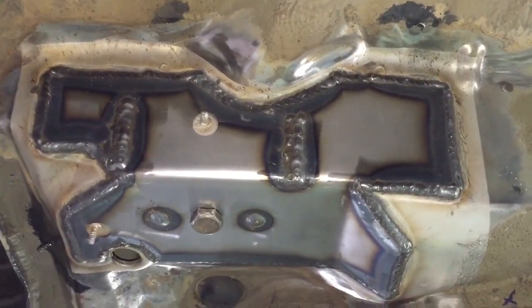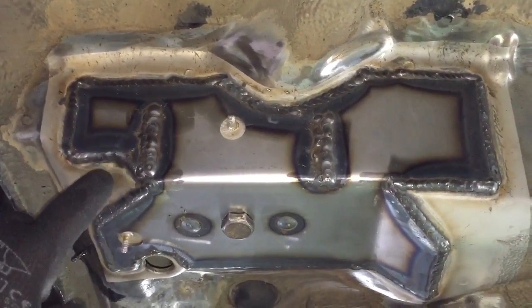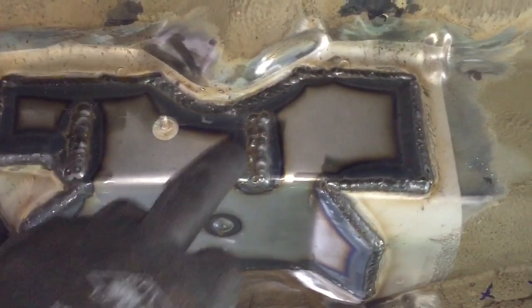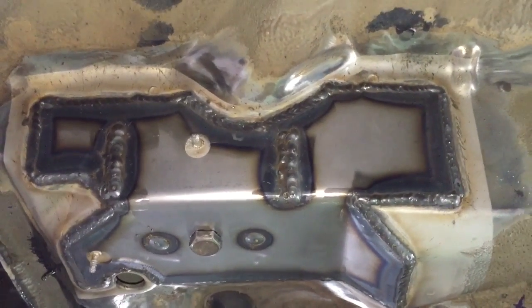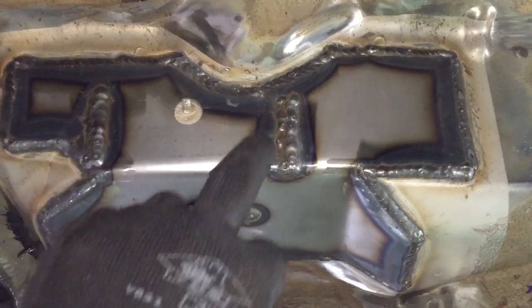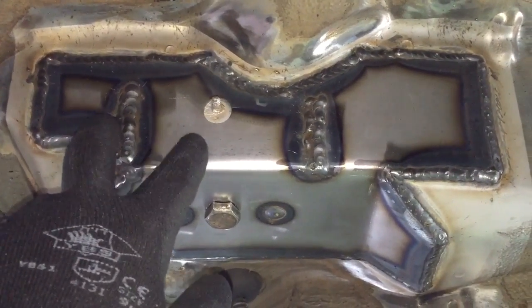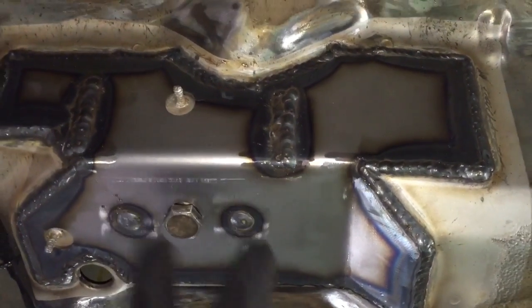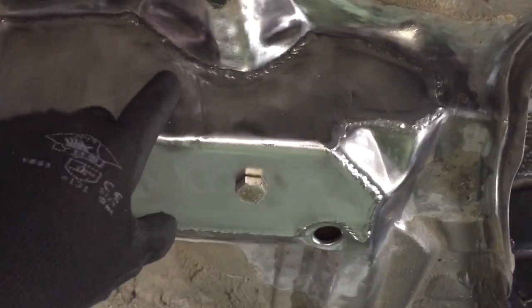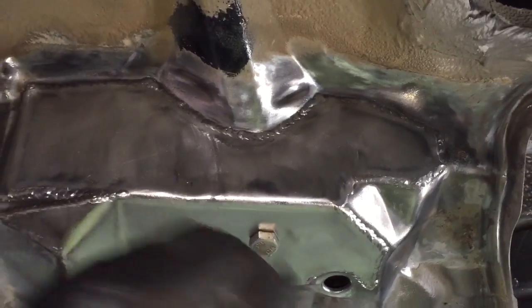On the right rear, we've made some changes in this corner to reduce the requirement for bending the plate around this section. We've also changed our vertical connection points from two slots to a single slot to reduce the heat affected zone, which is why you can see the heat affected zone is only effectively twice the size of the weld bead rather than spreading out like they used to. We've also reduced the size of the plug weld holes, so you've got much more chance of flattening down if you want that flush look.